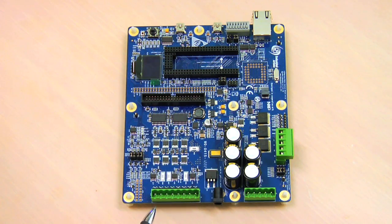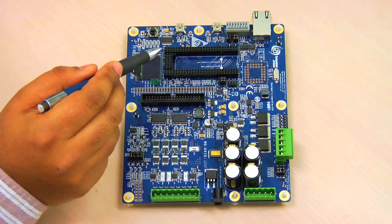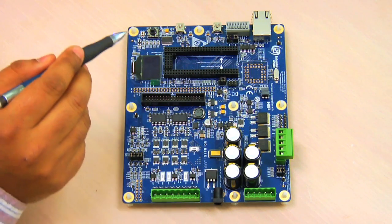This particular board has a motor control connector where you can connect a DC brushless motor, DC motor, a stepper motor, or PMSM motor. Another connector is for sensors — you can connect a hall sensor or a QEI encoder on this connector. On this kit, we can connect the LPC 1500 Xpresso board on this connector, and this becomes a motor control kit.